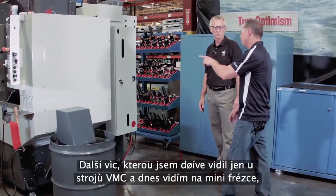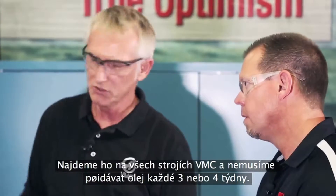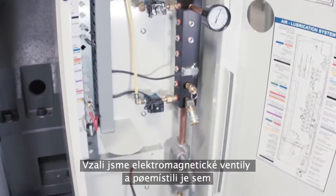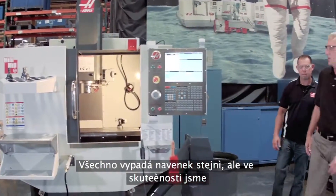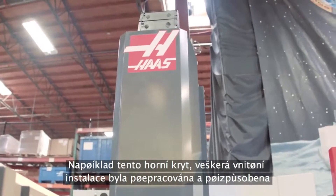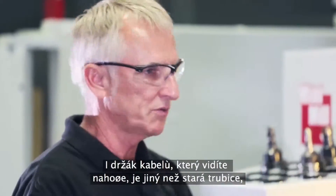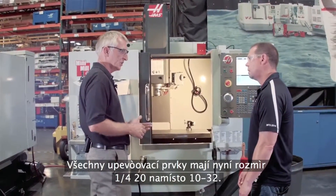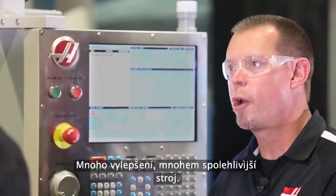Something I'm used to seeing on the verticals, and now I see on the Mini-Mill, is this lubrication cabinet. The min-lube system is really the heart of our reliability efforts — it's on all the VMCs. You don't have to add oil every three or four weeks now; the grease lasts for a year. We got the solenoids out of the head and brought them down here in a cleaner environment — easy to get to, you see everything. We have our new air pressure sensor on there and all the color coding. Everything kind of looks the same, but really we've touched every part on the machine. The head cover is re-plumbed and re-wired for the min-lube system to get more coolant flow to the tip. You can see the cable carrier we have on top now — it's different from the old tube, makes it more reliable, more room, easier for us to run things. All the fasteners you can see now are quarter-20, not 10-32. We have the new Haas Interlock — a very simple device, works great. Everything we could think of to improve, we touched — a lot of upgrades, much more reliable machine.